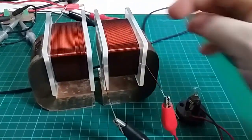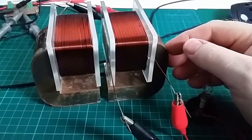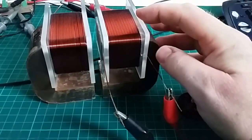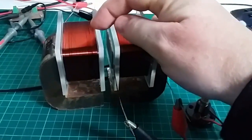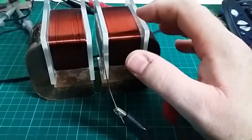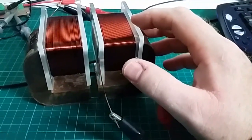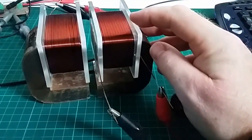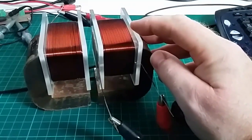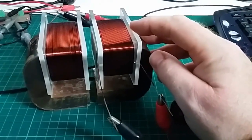So basically what's going on here is the coil can act as an antenna, and that's what Don Smith said as well. The coils are antennas. So we have a frequency where this coil can be resonant, we have a frequency where this coil can be resonant, and at these resonant frequencies the impedance of the coil becomes zero. We have a wire resistance which is still there, but at resonance XC and XL are equal, and the impedance thus becomes zero, or it drops right down.